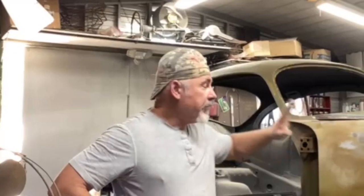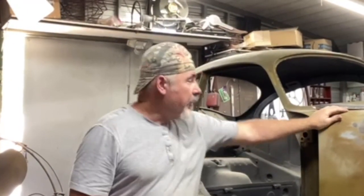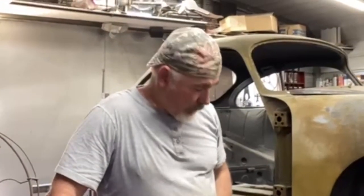Here's my car — this is where I'm at right now. I'm just fussing with the little low spots and high spots. I'm going to do a small skim coat of body filler around here. All the hard parts are done; all the lead work is pretty much done. I'm probably going to do a little lead work up here because the dent's kind of big, but I'm pretty sure I'm going to get most of it out now with this bullseye pick. Thank you very much and God bless.